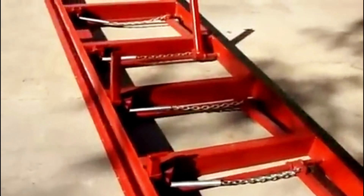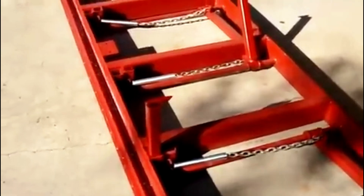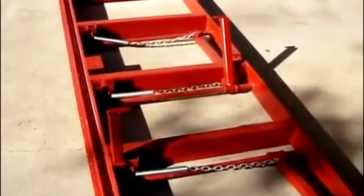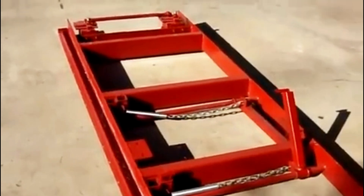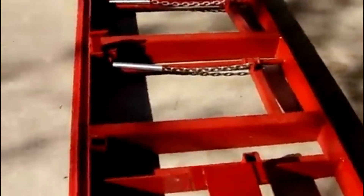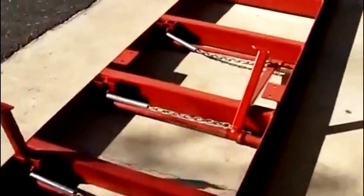The sawdog mechanism is the same as my first saw. I have varying lengths on the static end, and then on the other end, this is just 3 quarter pipe with 1 inch T's on it. You tap them with a sledgehammer, and then the chain and spring hold them together, and they bite into the log. They'll hold hardwood really well — mesquite needs to be really solid. Your steel service center can cut your parts, which they did for me, and I just welded it together. On the front I added a little piece so I can use a floor jack to move it around, and a set of wheels on the other side, which makes it portable.